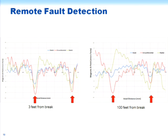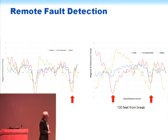This is another set of measurements. This is on about, I think, a 200-foot cable. There was a break in the concentric neutral about 3 feet from the RF source, and then these measurements were taken by moving the magnetic field sensor over the cable, starting about 3 feet from where the break was. So this would be like 6 feet from the feed point for that cable.